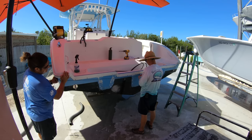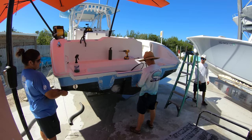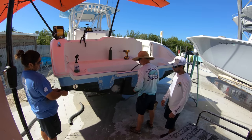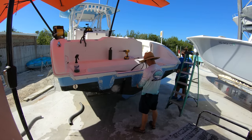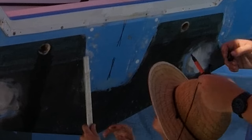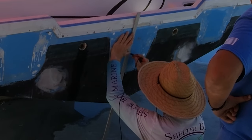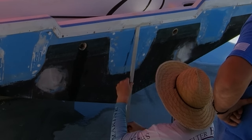The process of finding where the centerline of the boat is is actually pretty easy. We just need to take a string and a pencil or marker and go from the corners of the boat and the strakes and make arcs in the middle of the transom. We'll want these arcs on the top and bottom in the middle of the transom from both sides so that the arcs will interconnect at a specific spot in the middle, giving us our exact centerline that is also in line with the keel of the boat. Then we can take a straight edge going from where the arcs cross on both the top and the bottom and mark a line down the middle of the transom.